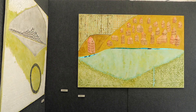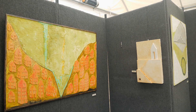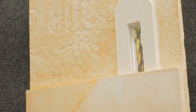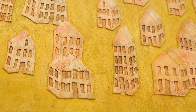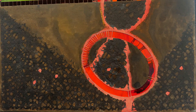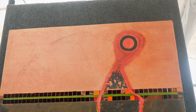The concrete itself, yes, it's store-bought, but my average recipe has about nine ingredients. There's a lot of acrylic in it, there's never steel, and I use a lot of fiberglass reinforcement — so it's basically better living through chemistry. My original lightweight concrete formula came from bridge repair, which is part of how I can put glass in it, because the concrete is actually softer than sidewalk cement but much, much stronger.